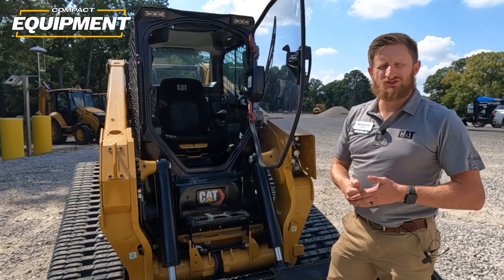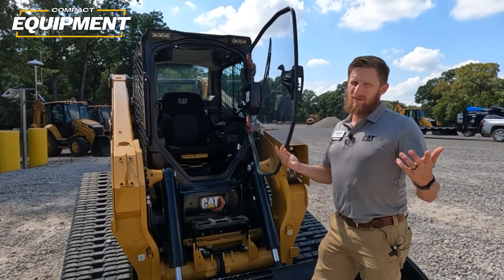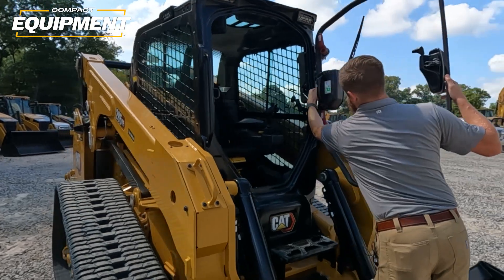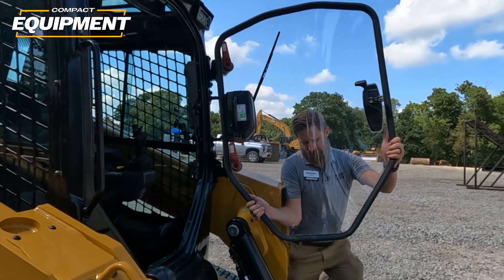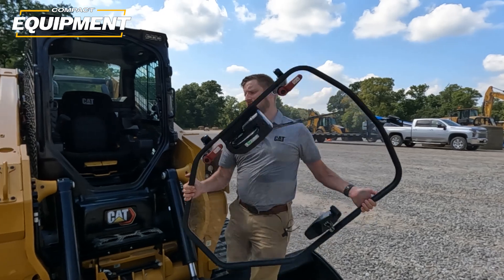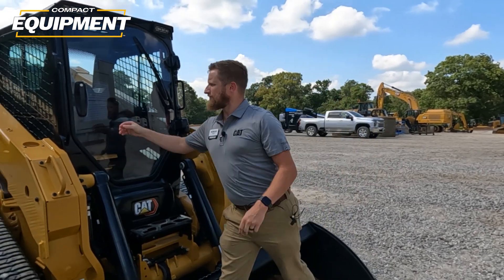No longer will there be days that you get stuck in the machine with some tools and aren't even able to open the door — we've got you covered there. And if you have a tool like a tree spade where you can't get the arms down far enough, or maybe it's a really nice day and you want to run without the door on, we've got you covered there as well. It's a two-step process to take the door off: unhook this harness, plug it in here, lift the door right off. You can set it aside and run without the door for as long as you want. When you're ready, bottom hinge, top hinge, door goes back on, hook the harness back up and you're good — that's all built into the display.